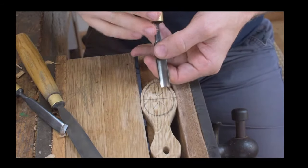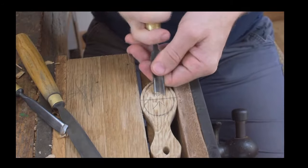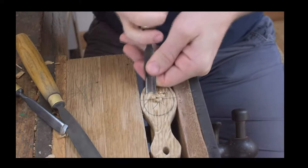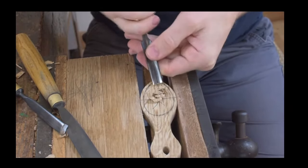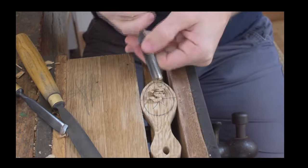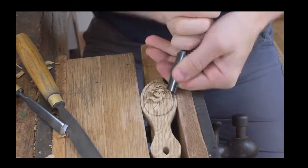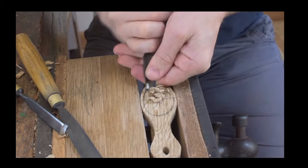If you're doing other wood carvings you have to try and assess how you can mainly be working with the grain of the wood. We start working into the center, carving with the grain, working into the center and back to our outside line. Keep working your way back using those lines we've marked to guide us. There's no need to carve those lines if you don't want to — I've included them because a lot of you are going to be starting out and it's difficult to shape just by eye.